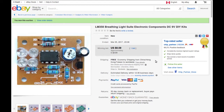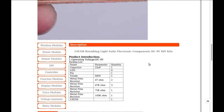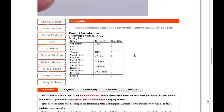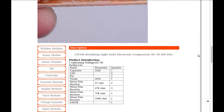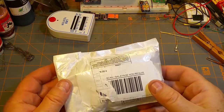From chip partner, free shipping from Hong Kong. Parts count: the transistor is an NPN — they call it a triode, which technically it is. Resistors: 47 ohms, 47k, 75k, and 100k. The LM358 dual op-amp itself, an LED, a capacitor, and a pin — maybe that little chunk of wire that was in the kit. Anyway, that's going to be a fun little thing to throw together on a rainy afternoon.